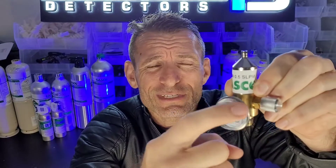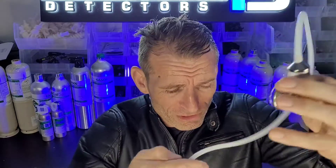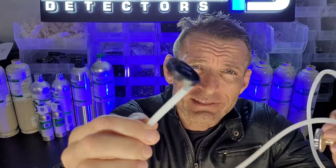We sell several different types of gas regulators. The one on this bottle is our fixed-type gas regulator. When you turn it on, a fixed amount of flow of 0.5 liters per minute will come out. That is your pressure gauge — it tells you how much pressure is in the bottle. That is your on-off knob, and up top is the outlet barb where you pop on your tubing — about a 4-millimeter diameter barb. You pop on your silicone tubing, then pop the other end onto your calibration cap to deliver the gas to your detector for calibration. That's basically the setup of every type of gas detector calibration.